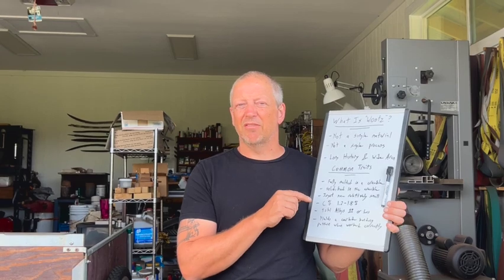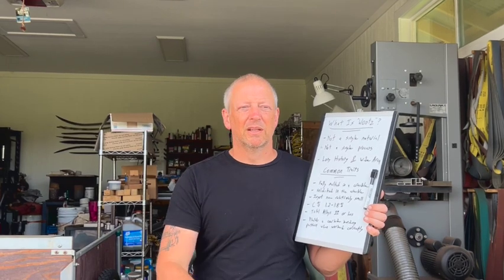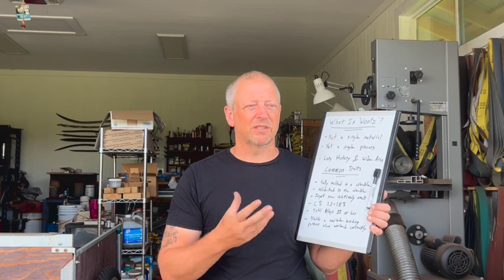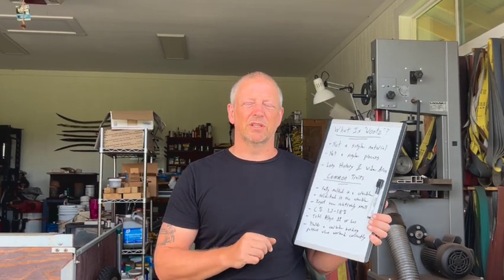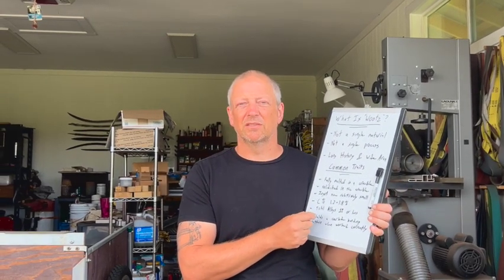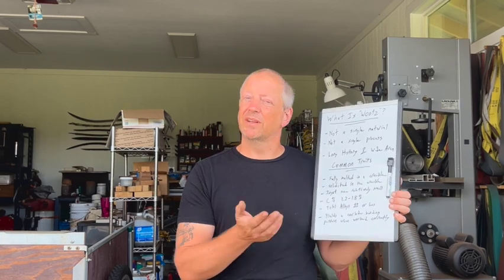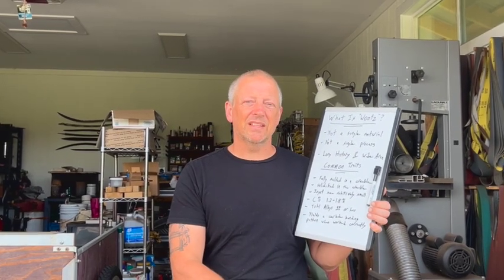And so materials that fall outside these traits, they aren't Wootz. So you can have a crucible steel. If I put materials into a crucible and I melt them down, I definitely have a crucible steel, right? If I put steel in a crucible, melt it down, I've definitely got a crucible steel. Wootz is a subset of crucible steel. So if my crucible steel has less than 1% total alloying elements and falls into that carbon range, hey, it's Wootz. If my crucible steel doesn't meet both those criteria, it's not Wootz.